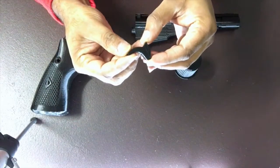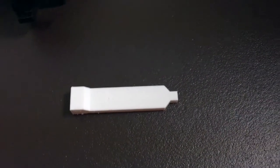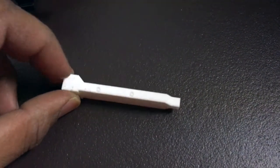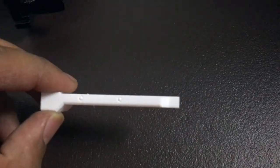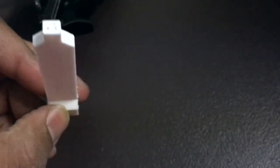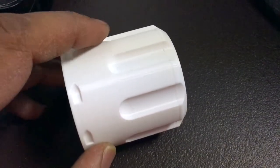I also printed a little trigger piece that goes at the bottom. Now here are the things I printed in the white PLA — I had to turn the light down a bit because it was reflecting off the white. I did have a few zitting issues here, but that was due to high temperatures I used in the beginning. This was a separate print from the black PLA, so I was still new and testing. But overall everything is pretty good — this one is probably my favorite piece once I had everything dialed in.